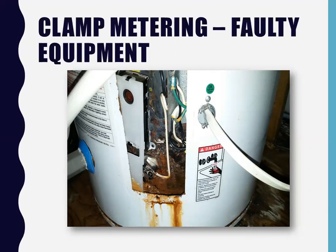So once that insulation gets moist and it's laying on top of the circuit board, it goes ballistic, and it will just start driving 10 amps worth of straight current into the ground side, and hopefully your ground is good.